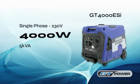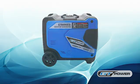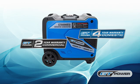4,000 I think would have been a bit small. By the time you got a fridge and a freezer, and in our case we've got a pump here for our water supply, and also our septic system, because we're semi-rural, we're on a septic tank system. So by the time you get that system running, the pump running, some freezers, lights, 4 kilowatts, you're going to struggle. So that's why we ran with the 6 kilowatt. 8 kilowatt would have been better, obviously, but again, it's a little bit of a compromise between price and, I guess an 8 kilowatt would have been a nice to have, but not essential, so that's why we ran with the 6.